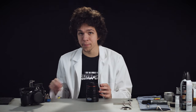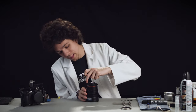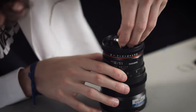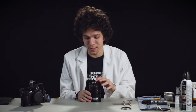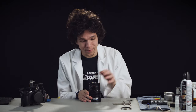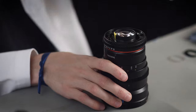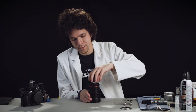We're going to get a tiny paper tape triangle that lines up with this. Here's my line, here's my triangle. It's not the best alignment but it's good enough — we're going to probably have to fine-tune this later. And then use the lens wrench to loosen the initial tension on the rear element, but as soon as that's passed, you can unscrew it until it comes down.